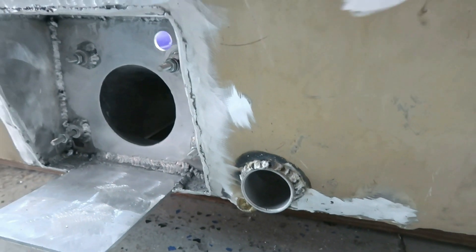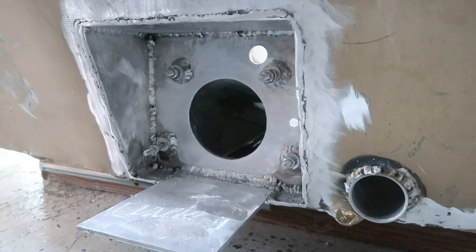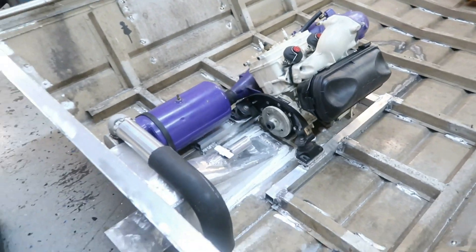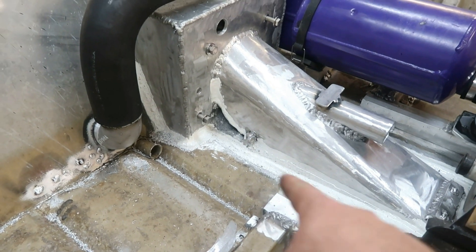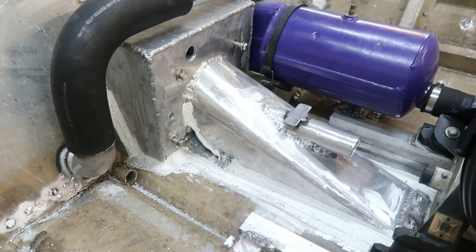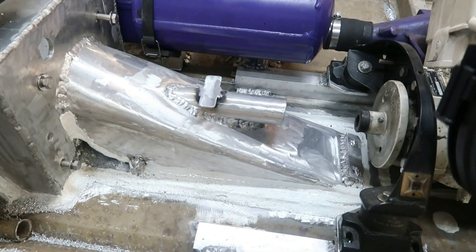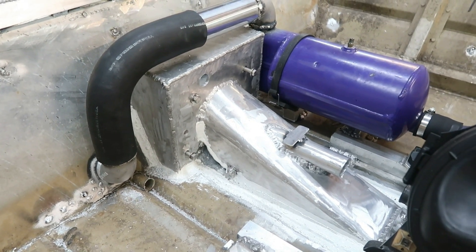Here's a shot of the inside of the intake unit — grates installed down there. Like I said, it's not all bolted in but the drivetrain is completed. I went ahead and sealed all the welds on the intake that I set in here — I used 5200 caulk just to be safe. I don't want to be dealing with leaks that I'm sure would have happened if I didn't do this, so I just went ahead and eliminated all that before the first water test — one less thing to have to worry about.